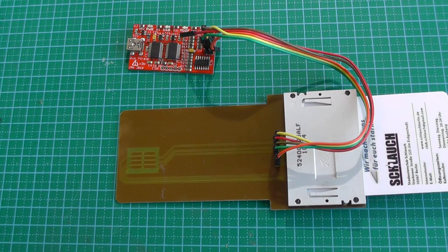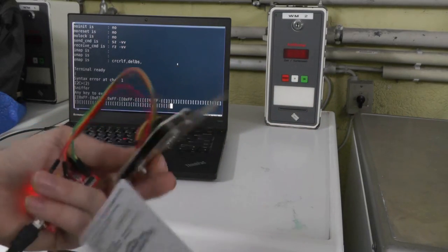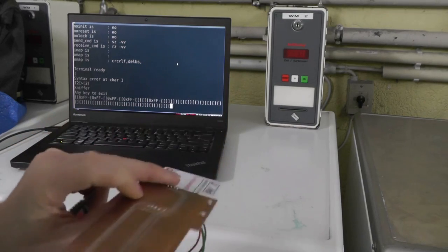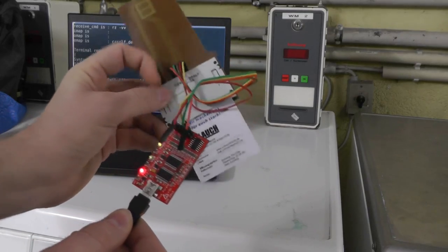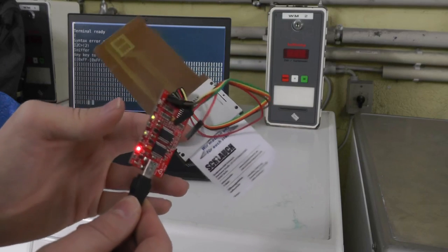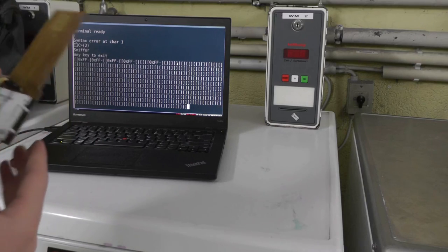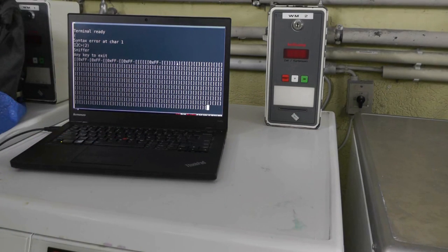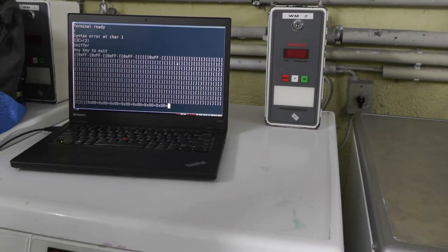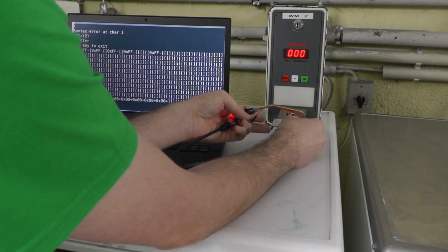Let's try that out. To find out how the machine works, we will use the sniffer. So we'll put the card in the proxy, which will just forward the contacts, and on the pins we just monitor the communication with the Bus Pirate. Here we have the Bus Pirate in I2C sniffing mode, and when we insert the card, we will see the traffic. So we just close this damn door, and then we insert the card.